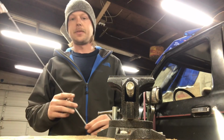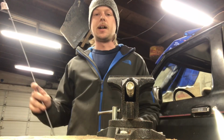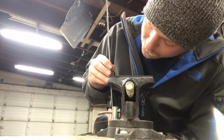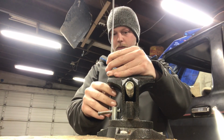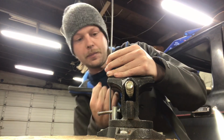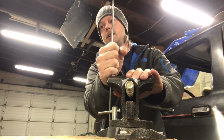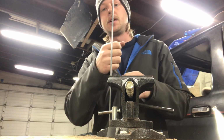I also have a little bit of a different way to bend my bars. Most people use a bender, which I have one now. I like to use my vise. What I do is put it in the vise, get it to where it's almost pinching, but line the mark that I made up with the top of the vise. I'll then wobble it straight, tighten it down, and double check. Of course, you always want to double check because screwing up sucks. Then you'll give her a bend. For me, I estimate my bend and I'll go back and either bend it out more or decrease the bend.